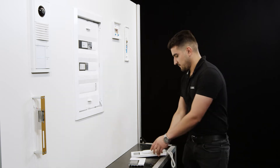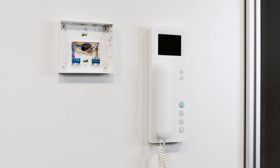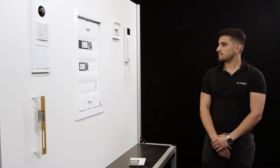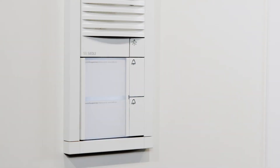Now, attach the upper part of the in-house telephone housing. Leave the handset on the hook. You will hear the story call tone and the mute LED will flash. The top call button is now assigned to the in-house telephone.